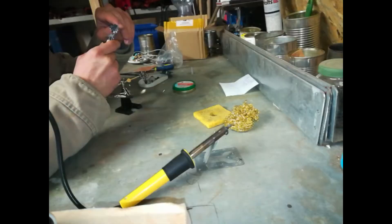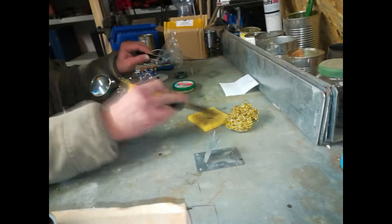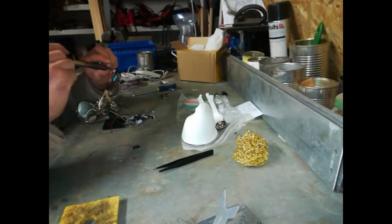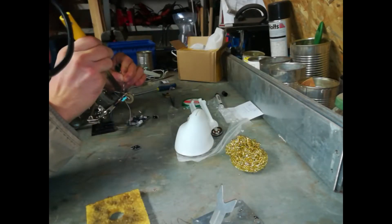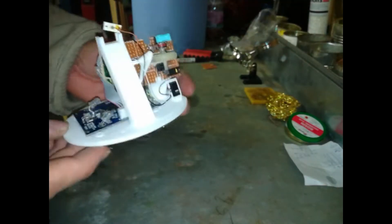I salvaged a few other mice which had working microswitches. I used pieces of prototyping strip boards to mount the switches. I screwed up a few, but in the end I managed to make one that suits my needs. I know it's not pretty, and I'm not that good at soldering, but the cover is fortunately not transparent.